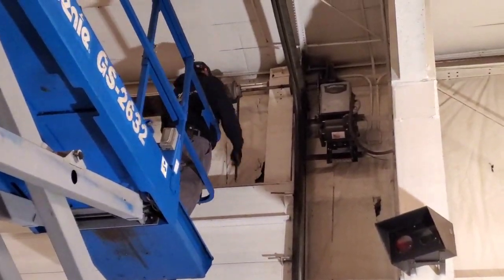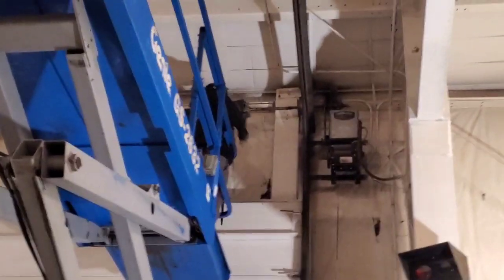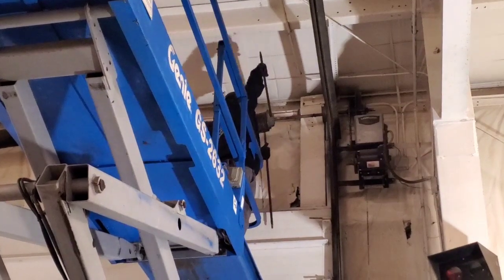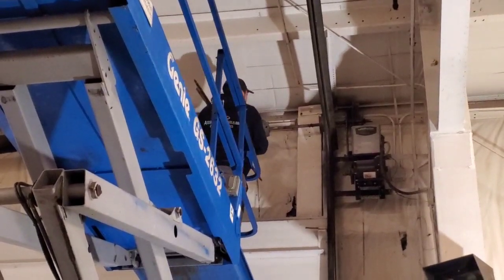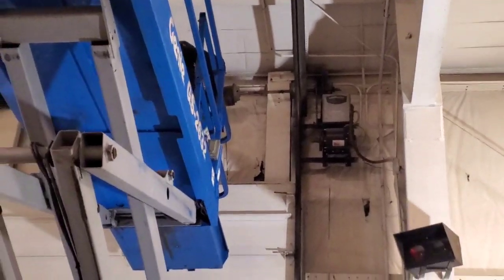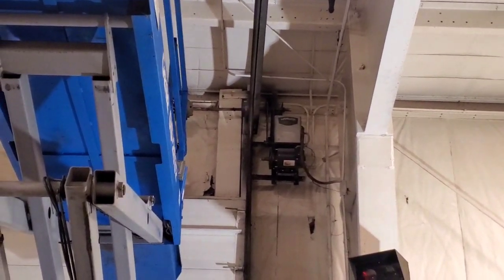A little story on that LiftMaster up there. When I got that LiftMaster, the bearing went out within like 3 months because they got brass bearings in them. They don't have roller bearings. So I ended up putting a puck one on there. That was kind of disappointing for the customer. Brand new opener, 3 months later it blew apart. I guess you can get them with bearings in them, but I didn't know that.